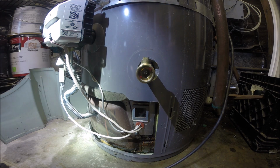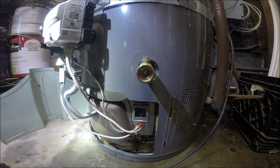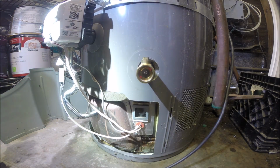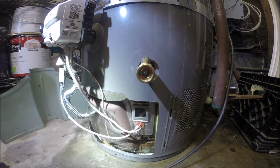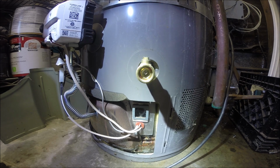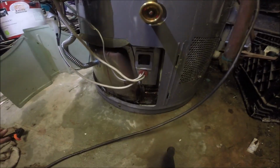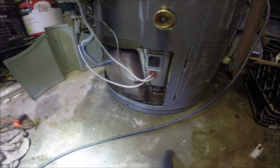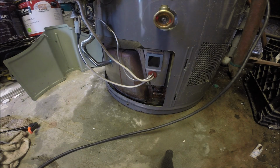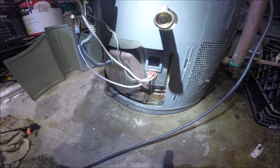Restart it. I kind of pump some air in there too. Just reverse the flow from the vacuum to just kind of blow a bunch of air in there. Helps kind of push some of the water out of the spots. It just kind of gets oxygen up in there. But yeah, she lit up and she's going, making hot water. I've done, I don't know, probably 20 of these like this before. But anyway, that's it.